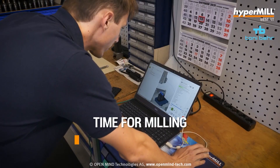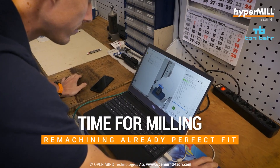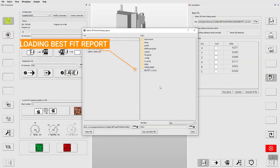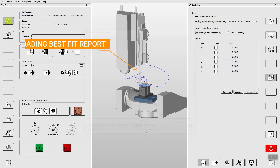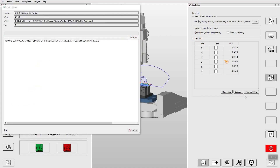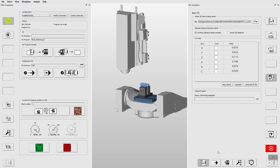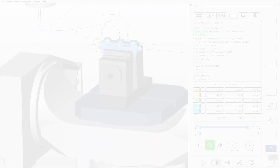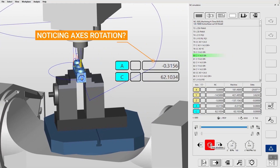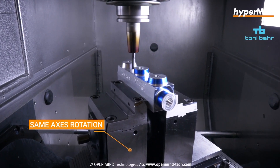That's the right word — manual — as we're doing it automatically. If it was a three-axis movement, X, Y and Z probing would be quite simple on the machine. But that's not always the case with castings — they may be twisted, they may need a fourth and fifth axis move to get the stock in the right position. To do that manually would be very time consuming, and if I'm making changes on the machine tool manually, the whole point of having a CAM system is you can post it out, simulate things and make sure they're okay.